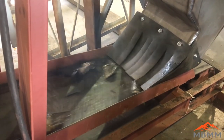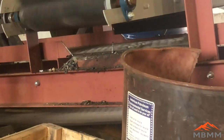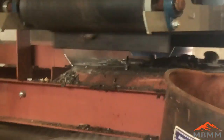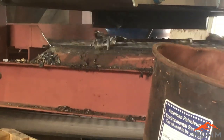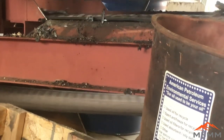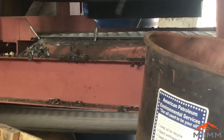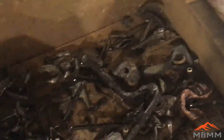These brass radiators were actually really nice because they came out in such large pieces that they were very easy to pick. Sometimes they came out in such large pieces that they got caught on the fins of the mag belt and were swept into the steel bin. At the end of the run we just dumped out the steel bin and picked out any of the large pieces of brass that got swept off. We pulled all those out, so it ended up being just clean steel waste at the end.